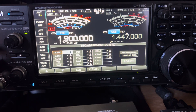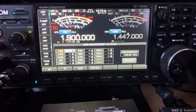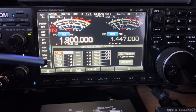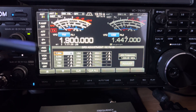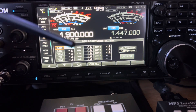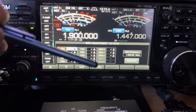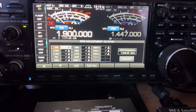They've also got the RS-BA1 with a different firmware as well. This is available for multiple radios — definitely the IC-7300, and I'm sure the IC-9700 as well. You need to download the firmware and have a 100 watt dummy load connected. Then you go through all the bands and it calibrates to make sure the output is 100 watts.